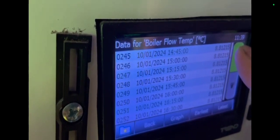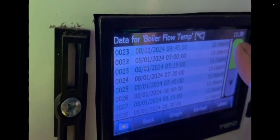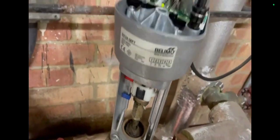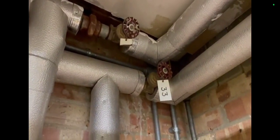I'm trying to go back to see how long this building has had no heating, because sometimes you're not given the full story — you have to investigate yourself, and it can be logged on the system. I was back up at the calorifier looking for heat. I had heat going in on the flow but not much on the return. I wasn't sure if something had been isolated deliberately — often engineers aren't in the habit of leaving labels so you can understand what has been shut off.